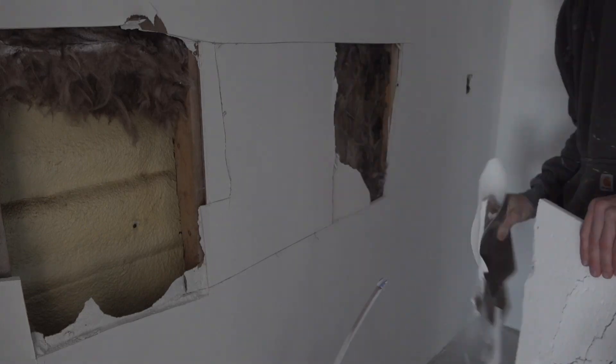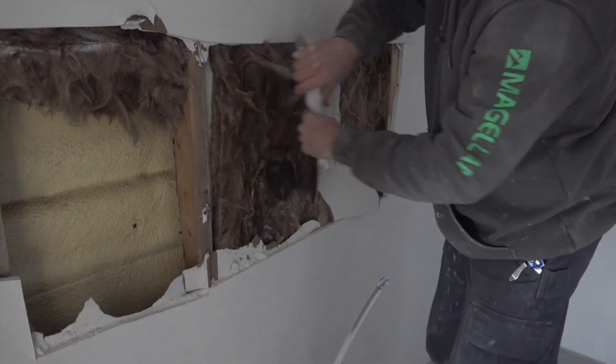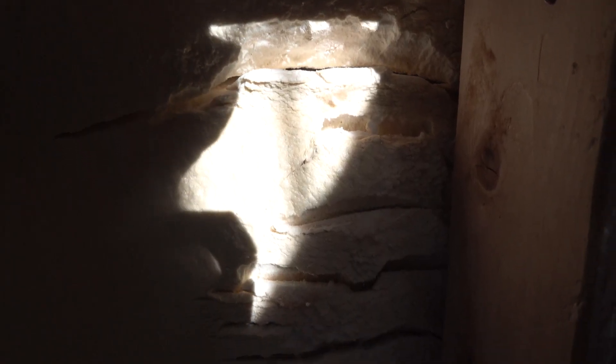Pretty much everybody that's been out here, along with Mike, has agreed that in my situation all the exterior drywall needs to come out, the bad insulation needs to be removed, and then all of that closed cell spray foam that's there doesn't have to be removed — it just has to be brought up to spec. The voids need to be filled in, the screws need to be removed, the gaps and cracks all have to be filled in, and we're going to thicken up the spray foam.